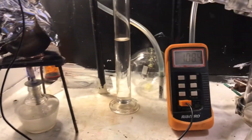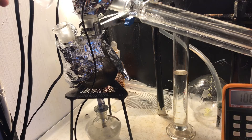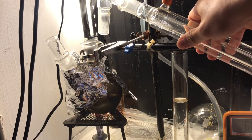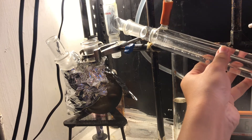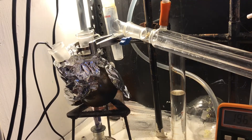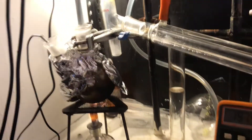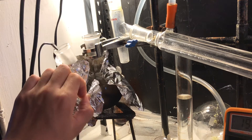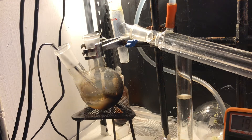I disassembled the distillation apparatus and just let the excess water boil off. You can see the acid is already pretty concentrated from the white fumes. I disassembled the apparatus and just let the acid boil down further, because it wasn't worth recovering anything else like nitric. You can see it's boiling around 200 degrees, so fairly concentrated sulfuric acid. If you want, you could just distill this and get your azeotropic acid, but I didn't bother with that.